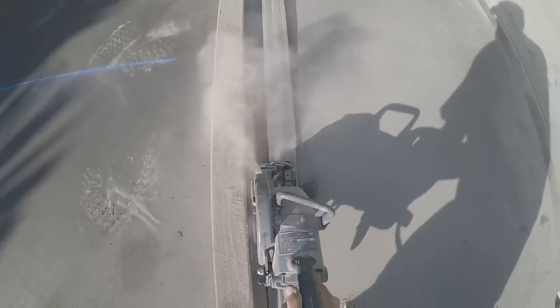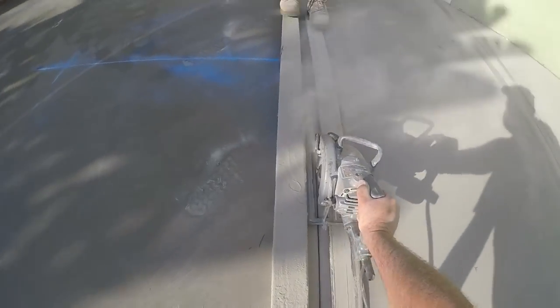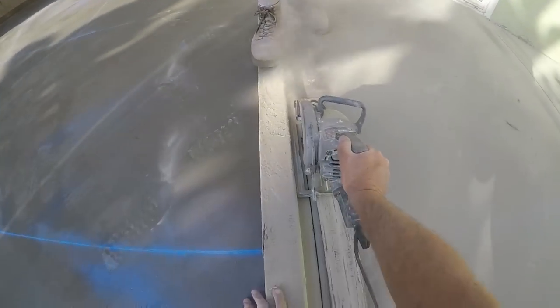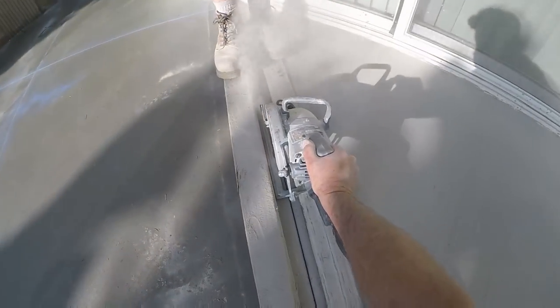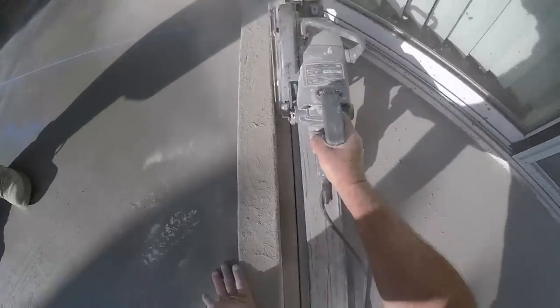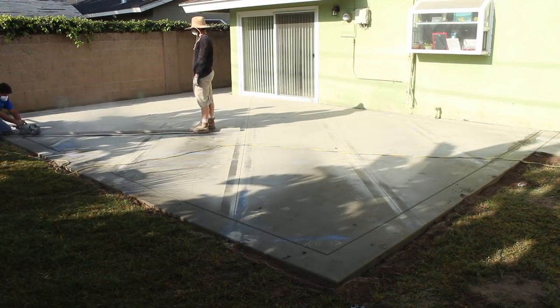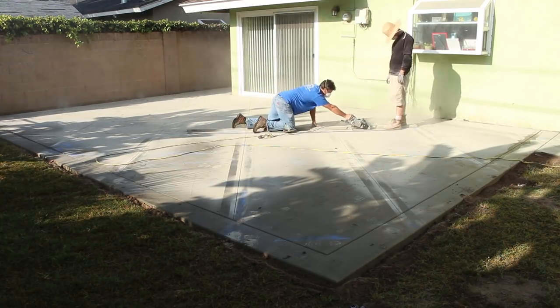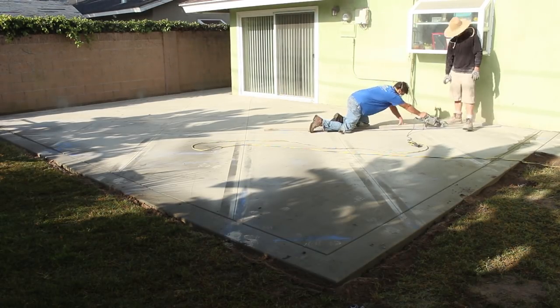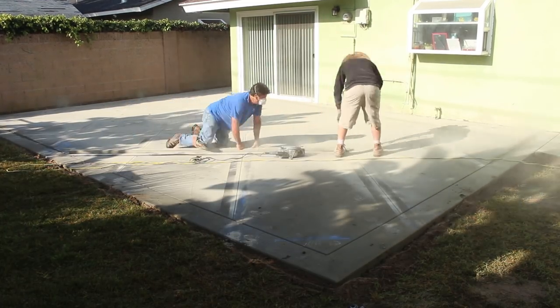You can cut these the next day because I put the fiber mesh in there — that holds the surface together. When cutting normally you get a lot of spalling from the blade on the next day and chipping on the cut, but with the fiber mesh that's going to hold it together and give you nice clean crisp cuts. If you do get a lot of spalling — for instance if you didn't use fiber mesh — you can always run a crack chaser through them and throw a little 45-degree bevel through all the cuts to clean it up. I like to keep the cuts and joints as small as possible because then it doesn't hold a lot of dirt or water, and both of those things contribute to staining and erosion.